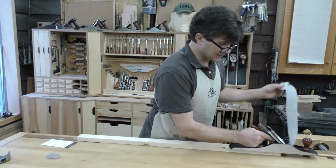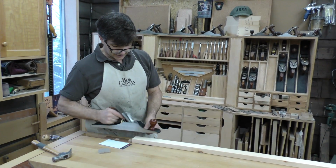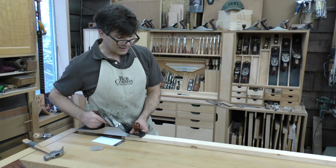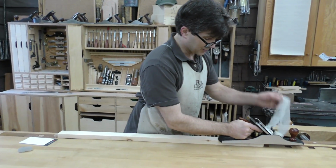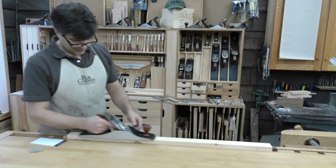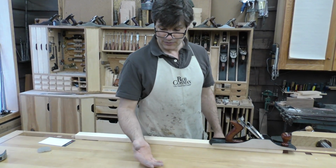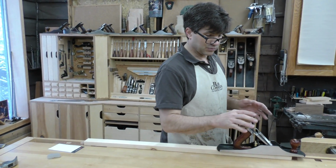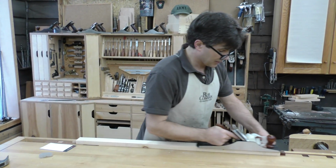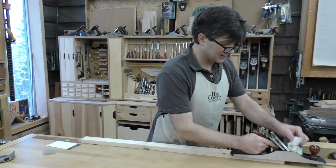However, if, as I had mentioned to you, I was dealing with a furniture component and I was just about to get rid of that last little bit of pencil marks, fingerprints, whatever, I'm not going to wax the sole under that circumstance. But during the process, any little bit of residue is going to come off. And to be honest, I've never had fish eyes, is what they call them, when some kind of a substance on the wood will cause the finish that you're applying to react differently. I've never dealt with it, so my answer to that question is no, it's not going to affect the surface, but again, as a precaution, I wouldn't do it on the last stroke.